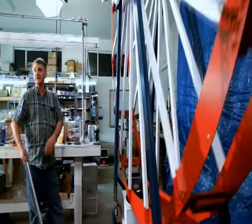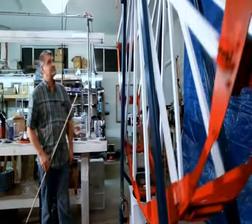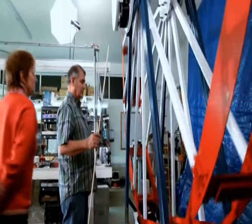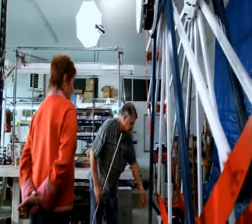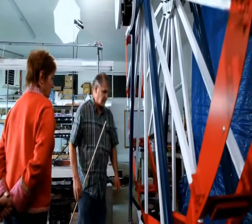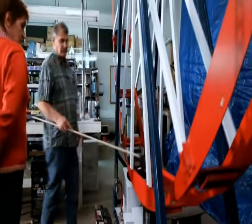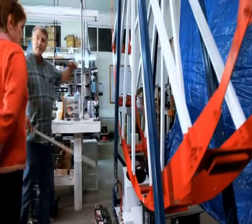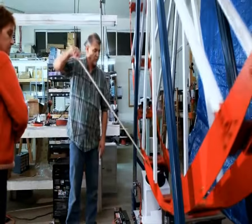Now, here's the problem. Here's the engineering problem. If we just tell the motor to slow down, let it come across the pole, these are magnetic locks in this condition. In other words, they're being attracted into the iron down here. This iron pole right through here.